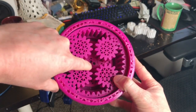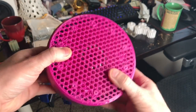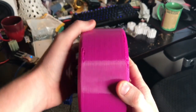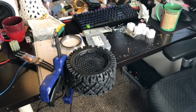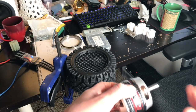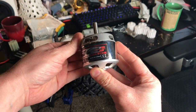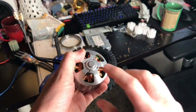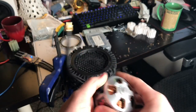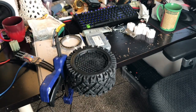That's the output plate, which attaches via this poorly-made design spline here to the wheel. And you can see there's a bearing in there. This is the rim, and then this tire is wrapped around the rim. This is the motor that I'm using — the Turnigy SK3-6354-260KV brushless motor. That assembly has a magnet on the end, and I'm using angle encoders. Actually, this setup is not using any encoders at the moment, but I have gotten it running with the encoders on a different fixture, and it's very nice.